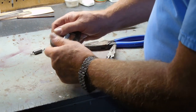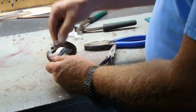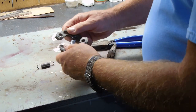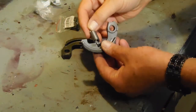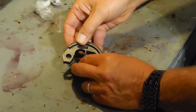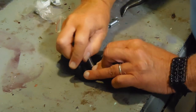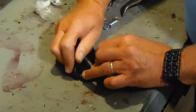You can see I can actually pivot those myself — no way I can do it with the original strong spring. If you've got a stronger spring and you need to put it back on, that can be a little bit tricky. The original spring has a lot of tension to it, so you're going to hook it and then lay one piece flat on your workbench and then pivot these on. I'm sure there's a tool that will stretch the spring.